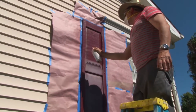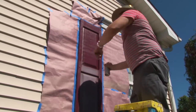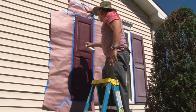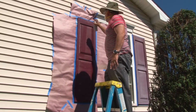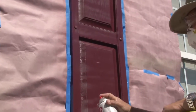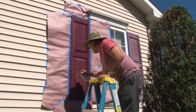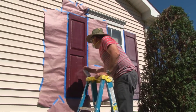I'm not trying to coat it all in one shot. If I miss a little area, it doesn't matter — I'll pick it up. Keep the wet edge, going with the grain. Keep the spray can about six to eight inches away from the area you are spraying. Applying too much paint at one time will cause it to run. If you're too far away, it will go on dry and be dull.